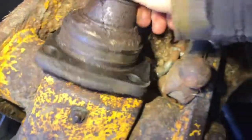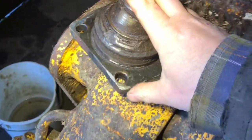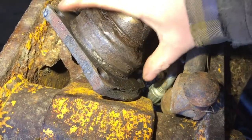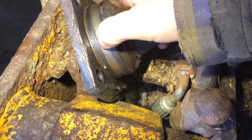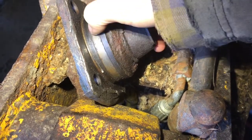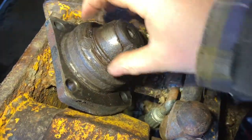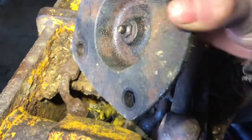There's a hairline crack just there, and another one just there — it's been there quite a long time. You can see the rust all along here; that's where it's come apart. There's a little gap at the bottom and actual metal on either side, but in the middle it just kind of floats — it's empty. Unfortunately the rust has built up and basically welded itself closed, which is why it was so difficult to remove.